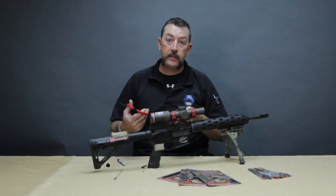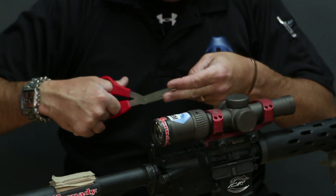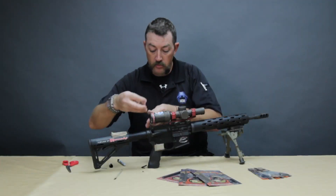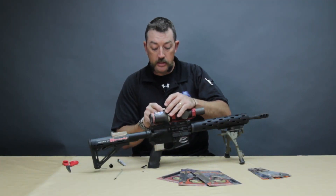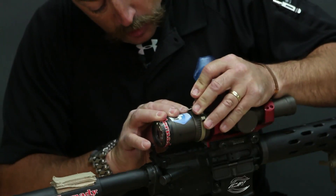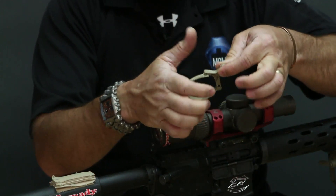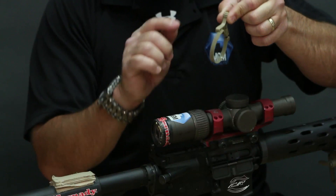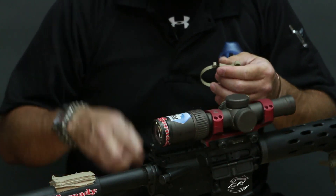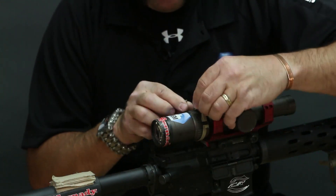If anything, err a little bit on the long side — it's a lot easier to take some more off than to add some on. So we're going to cut it right there. From there you can wrap it around. When you get it on there, make sure you just barely get the teeth started in there. You don't want to push them all the way in and completely compress them because that's going to be a pain to get out. We're just test fitting for right now. I'm going to back this off a half turn to give myself a little more room to work.